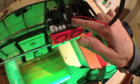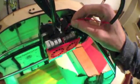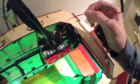So now we play the waiting game. The printer's now hot enough and I've pulled out this plastic tube. What you have to do is push down on this ring here first in order to get this black sort of guide tube to pop out. Now we can also hear that the motor inside was pushing backwards on our filament — and there it goes, she removes right away. So now we're going to pause it and start to load filament — we're going to load the green filament in the back.